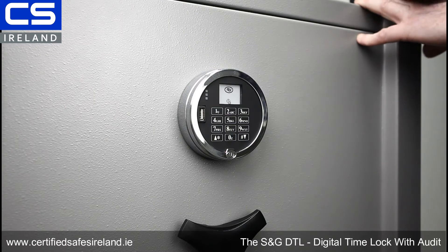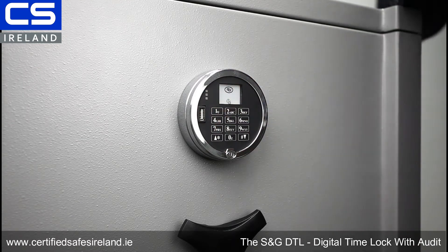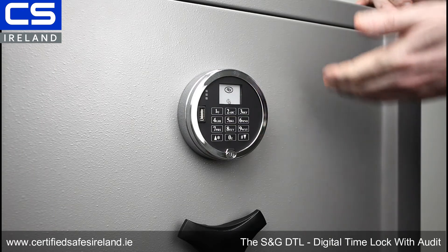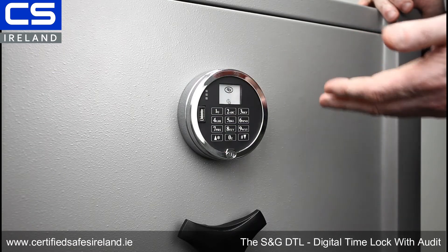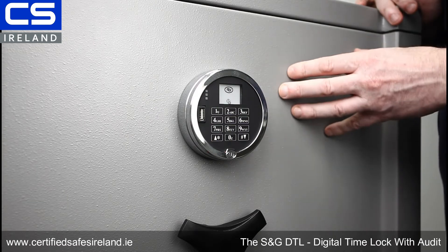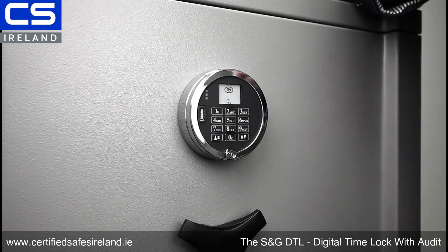Also, and this is the really amazing thing, it allows you to upload the time lock schedule via the USB port. This breaks a customer's reliance on a technician to do that. The situation to date has normally been that a technician might be going around with a laptop with your access codes on it, or they are the only people who have your code, and every time you want to set up a new time lock schedule you've got to phone the technician. But this puts the power back in your hands — once you have the programmer code, you can set up a time lock schedule from the comfort of your laptop.